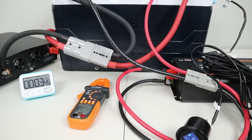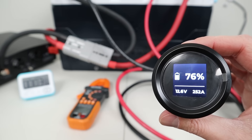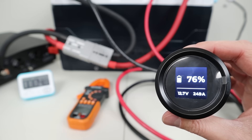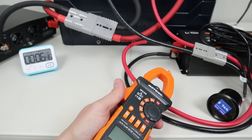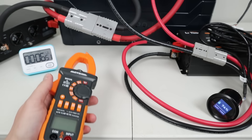It took a minute to get the inverters powered on and each heater running at peak load — it's been running for almost four minutes. Looking at the screen, we're pulling over 230 amps, peaking near 252 amps. The clamp meter shows about 77 amps on the small inverter and 174 amps on the large inverter, totaling right around 250 amps.